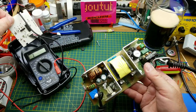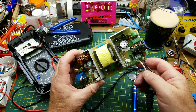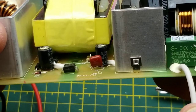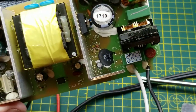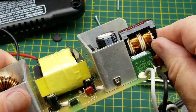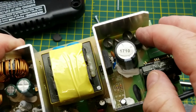The display board had power coming to it, so it's at least got a five-volt supply. AC power comes in, there's a four-amp 250-volt fuse, then a suppression capacitor, a suppression choke, a thermistor for inrush, another capacitor — a Class Y2 capacitor. The first one is a Class X2 capacitor, then a Class Y capacitor, another choke, and then we go to the full bridge rectifier.